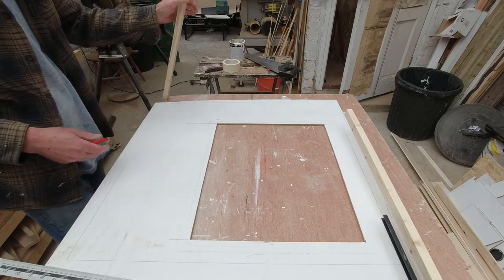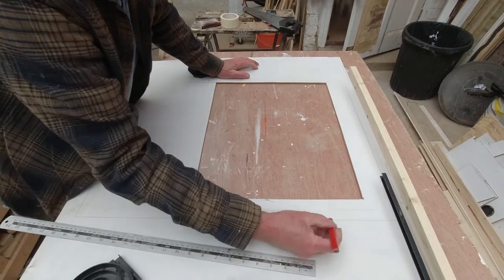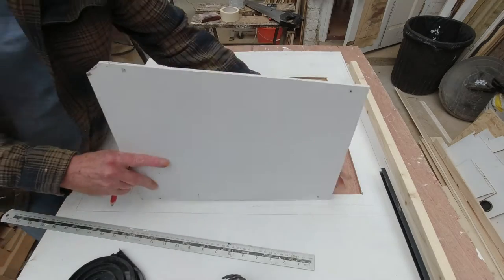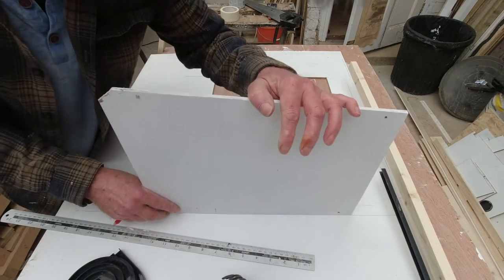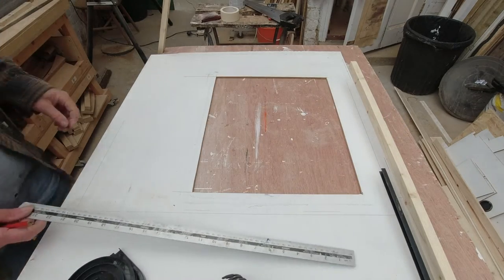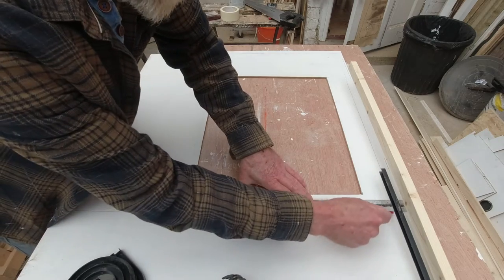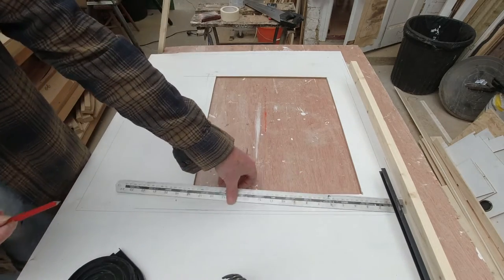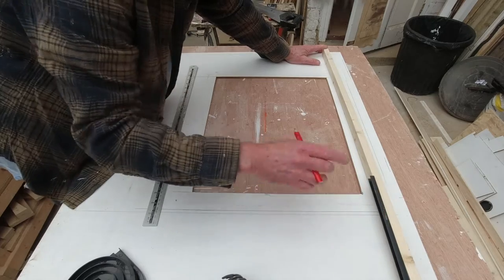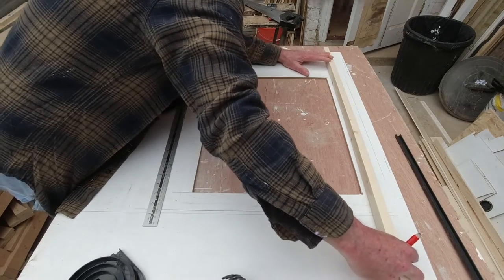We also know there's a bottom line here — this bottom line is the batten for the shelf. The shelf itself is also going to be on there, so we can make a mark in this area — just six millimetres up from that. If we draw that line, we can then determine the length of this batten which is going to go up the side, joining the top batten and the bottom batten. I'm just going to put a mark there and cut that off.